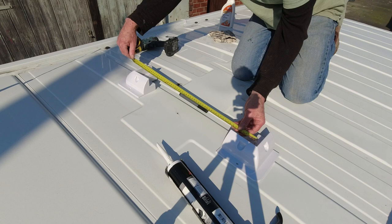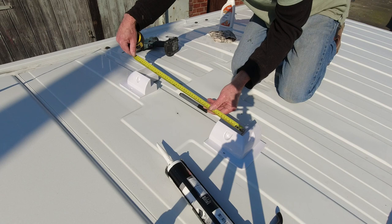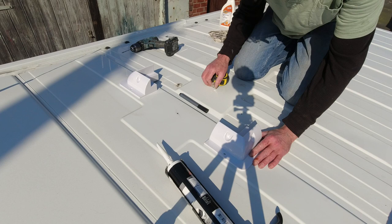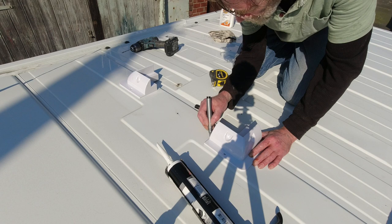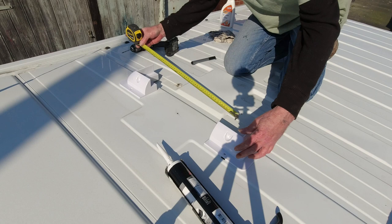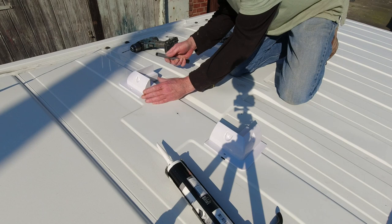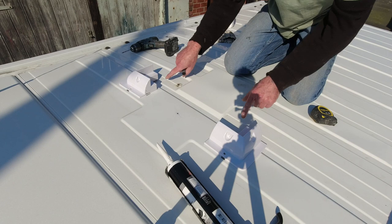Getting these brackets roughly positioned — the panel is 51cm, which makes that 25.5cm either way, so we have 25.5 to here and 51 there — that's the actual width of the panel. Getting the lines aligned: that one's lined up there, and that one is lined up there, and in between should be 51. I'm going to mark here so I can see this more easily, mark the side of it down there, and mark that as the top stop. Measuring once more — that's 51 — so I'll give it a little bit of wiggle room and adjust it slightly.